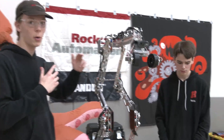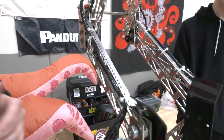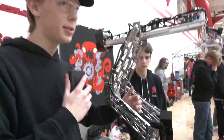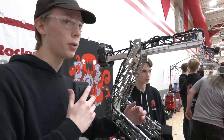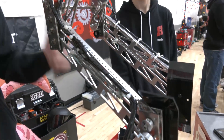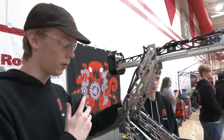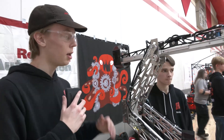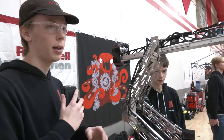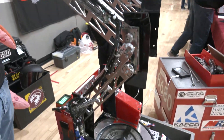It extends up about 35 inches in about 1.4 seconds, and we've custom CNC-machined these bars on our CNC router in our room. We've gone through a lot of iterations. They are thin and flat, so we've done FEA simulations and thought a lot about how to make them structurally stronger. We put returns on each of the stages — they're angled brackets running all the way down the bars — so it shakes a lot less. It's pretty stable. We did max deflection calculations and it turns out these decrease max deflection by about tenfold, so you're not going to see much bending. It goes up very consistently.